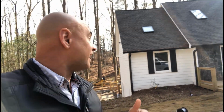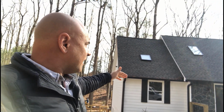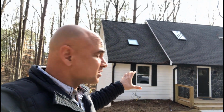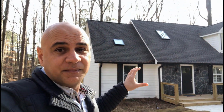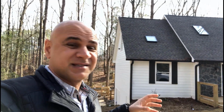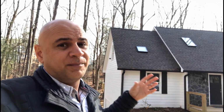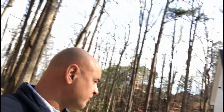You can imagine now all of the heights have been cut in half. We've got about 10 feet on the front of the house here, and if we place the lights where we would most commonly place them, then we're going to end up with those hot spots. We're going to be projecting that light right up into the bottom of that gutter, and it's going to just look like one big bright light reflecting off of the gutter without much light on the wall itself.